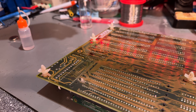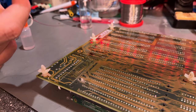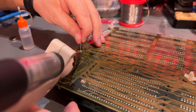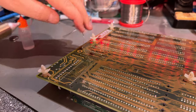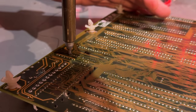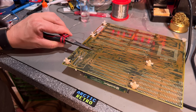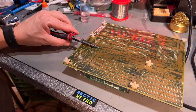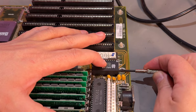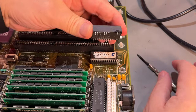There are a couple of pins that didn't clear, probably because there's some thick ground plane that sucks away the heat. So I just jacked up the temperature and added a little bit of extra solder there. Now this should be fairly loose — just try to wiggle the pins a little bit in case they are stuck to the sides of the holes. Chip is out.